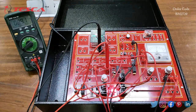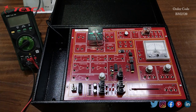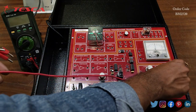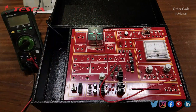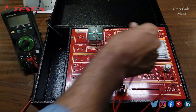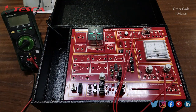That is how you can form the table and plot the graph between voltage and milliampere current. That is how you perform this experiment. Now we are going to perform another experiment: to study the characteristics of the photovoltaic cell. First we will do the connections — connect port C of the 10k potentiometer to plus 12 volt.